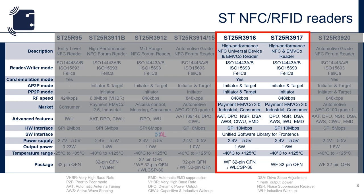Let's take a closer look at the ST25R3916 family. It features up to 1.6 watts of output power, an SPI that runs up to 10 megabits per second, and is ideally suited for payment applications. Compared to the ST25R3911B family, the ST25R3916 family adds such features as active wave shaping, a noise suppression receiver, and a drive slope adjustment. It also builds on the unified software library created for the ST25R3911B, which facilitates easy migration between the families.